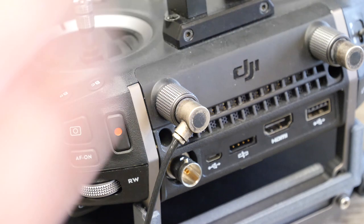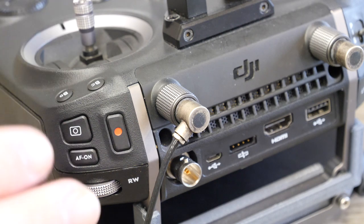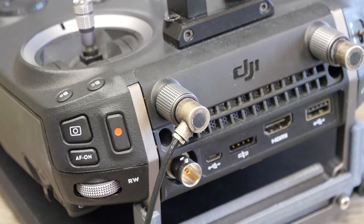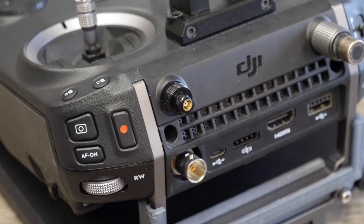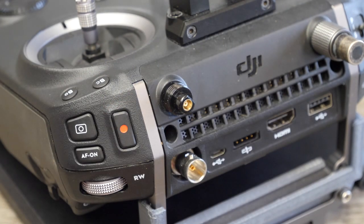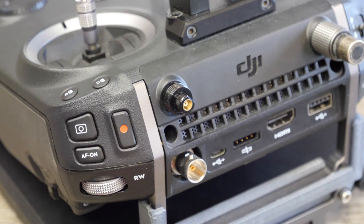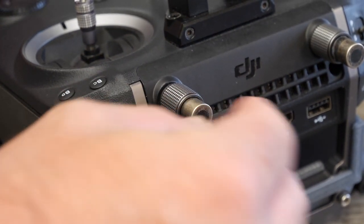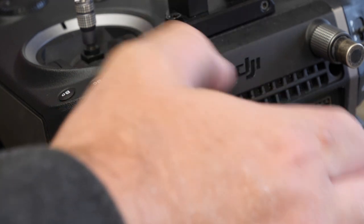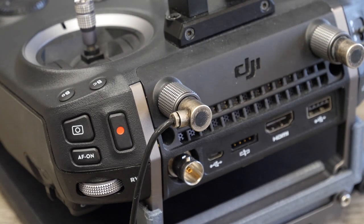Located at the top are your two antenna connectors — these are the removable ones, so you can switch between the omnidirectional sticks or the patch antenna as I've got connected here. To switch, you simply unscrew, give it a tug, and it reveals the connector below. Something to note: they are a little bit delicate, so be careful when changing antennas. To refit, place it over the top until it latches in place — it is keyed, so be aware of that — then screw the nut up nice and tight, and it's as simple as that.